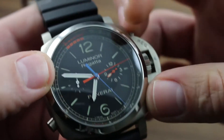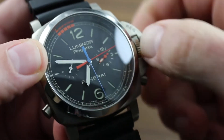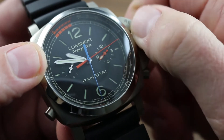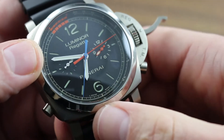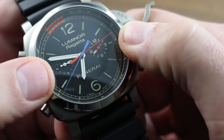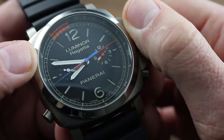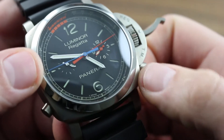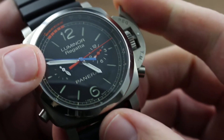There is also an intermediate crown position for frequent travelers, allowing independent setting of the hour hand forward or backwards when en route to a regatta event. The chronograph seconds hand, chronograph minutes hand, local minutes hand, and constant second all continue to advance while the time zone or traveler's function is engaged. It does not affect balance amplitude, isochronism, or precision.